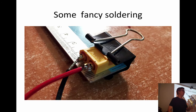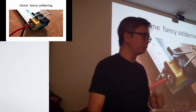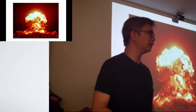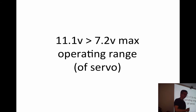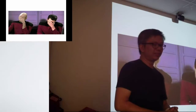We did some fancy soldering — I hadn't soldered in 22 years. I tried but couldn't really do it, so in the end I passed it to Shupeng who's better than me. We put everything together — and then it exploded. Smoke actually came out from the servos, and I madly scrambled to the robot, unplugged it, and realized what happened. I thought it was a 2-cell 7.4V battery, but it was actually a 3-cell 11.1V battery, and the max operating range for the servo was 7.2V. Not a good idea. It burned 8 servos. Really bad.